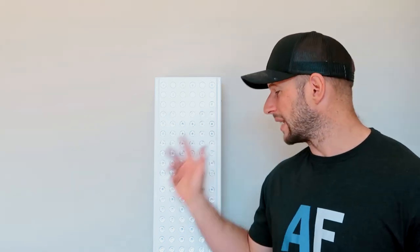Okay, that's all done. Unfortunately, the peak readings I was getting don't line up 100% with the peak figures listed in the manual and on the box. For instance, 70% of the LEDs are listed at 630, but the peak I had for those LEDs was actually closer to 640. That's quite a difference. There was a bit of light coming through at 630, but it was much closer to 640 than 630. The 660 peak I was testing at 665, so again, that's a little bit off. Remember, there is always a bit of a range, because these aren't lasers, they are LEDs.